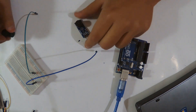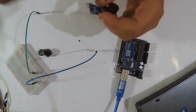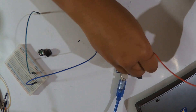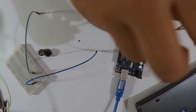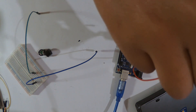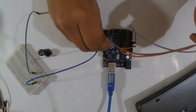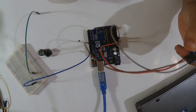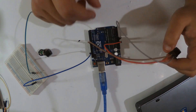First I'm gonna try the module version. I wired VCC with 5 volts — you can use 3.3 volts but it's not as powerful, especially if you want to use it in a security project or alarm system. Ground goes to ground and 5V or 3.3V from Arduino, and the in/out pin goes to a digital pin — you can choose whatever you want, I'm using pin 8.